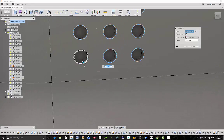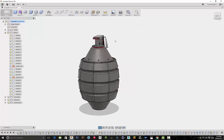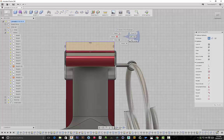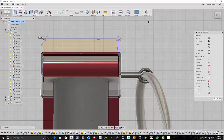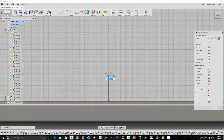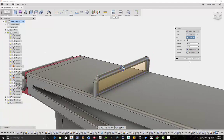I'm going to select all of these edges and apply a chamfer — going for hard edges this time. I selected that work plane and I'm going to use the sweep function again, creating my double safety over here. It's up to you if you want to include this in your design. Just like what we did earlier, I'm constructing a plane along a path and sweeping a circle sketch along this path, creating it as a new body.